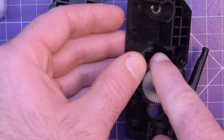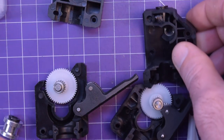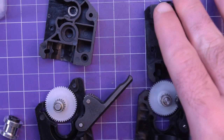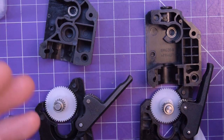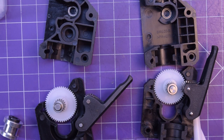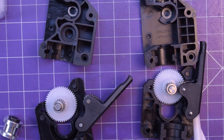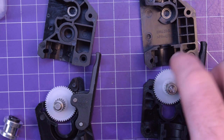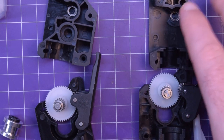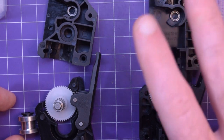You'll even see this is a nylon with glass fiber reinforcement — it just wore into my nail there. I think this is a higher quality unit and I paid $5 more, but what's the difference between $30 and $35 if it's going to be the extruder I'm going to use anyways. This can also be remote mounted with a long Bowden tube if you want, but that kind of wastes the talents of the dual gear extruder. I'm pretty excited to take a look at this and give it a run. I might install it on the low cost printer first to see if I can get a feel for it.